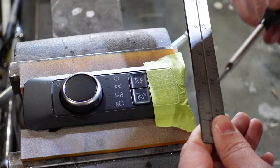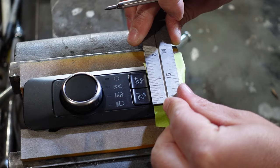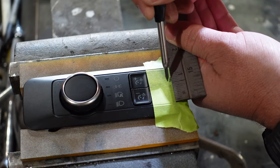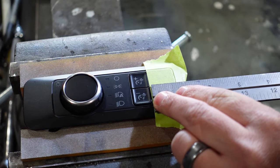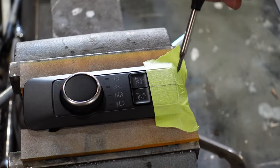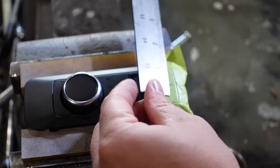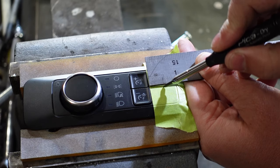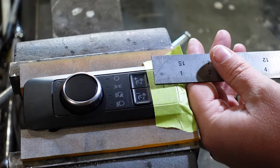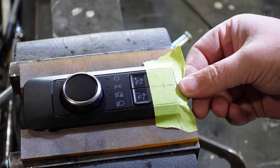Doing the math — one and three eighths, cutting that in half, that becomes 11 sixteenths. I went ahead and marked 11 sixteenths on a ruler and it lines up perfectly with the middle. I'm just going to come over here now to this edge bezel to get my other side. Now I can just come across from that center line and the line that I just made. I said 15 sixteenths — that becomes 15 thirty-seconds. Luckily this ruler has thirty-seconds on the other side, so I just count 15 of these little tiny lines. And so here we're coming in — 15 of those tiny lines. Just to check center, I measured from both sides and they line up — we're right here, pretty dead center.